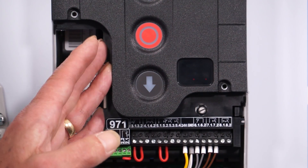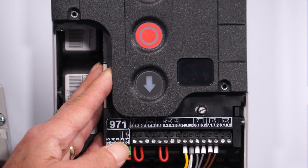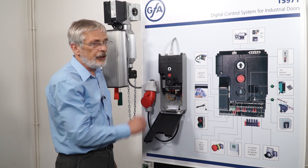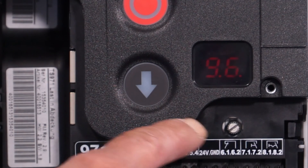If you don't know what's causing the interference, change the channel that your wireless safety edge device is programmed to. If the TS971 is intermittently displaying F1.6, you can go to parameter 9.6 on the TS971. When you press the dial, it'll show you six different values. The final value before it goes back to 9.6 is the signal strength in percentage.